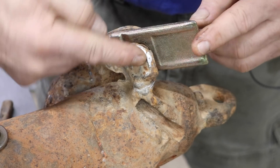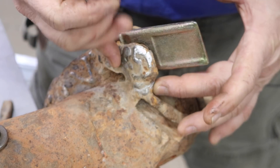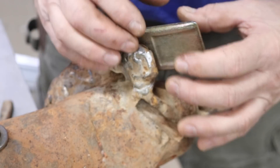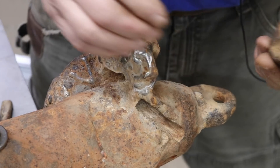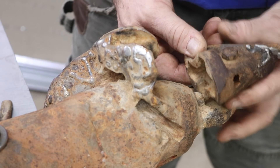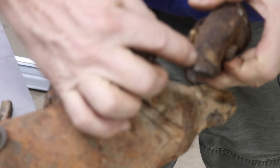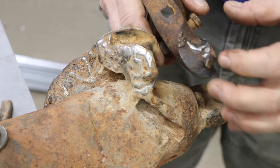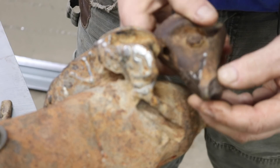Now here we have about a quarter-inch gap between this and that, which is not going to really hold this real well. I'm going to cut a lot of this away and probably clean this up to try to put in some more steel or a piece of steel and weld it in to give it some backing. The other side is in a little better shape but still needs a lot of work. The tip is off. We didn't try to find a new one yet, but if this all works, we're probably going to find a new tip for it. I'm going to grind in here to give this a little bit of grabbing, cutting action, kind of like a drill bit to at least get the auger started. The new teeth up here will be a huge improvement.